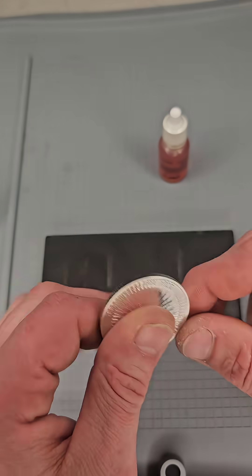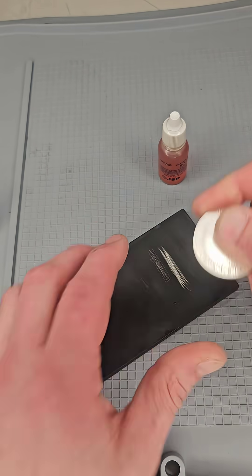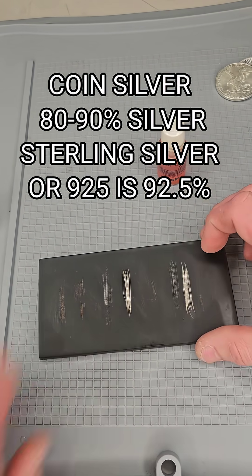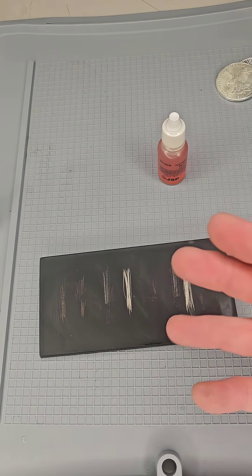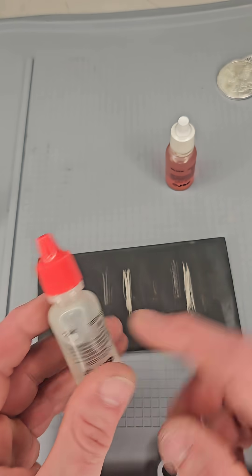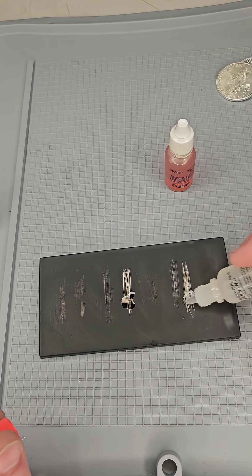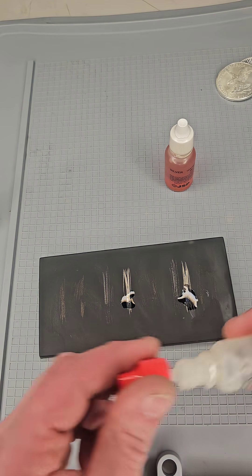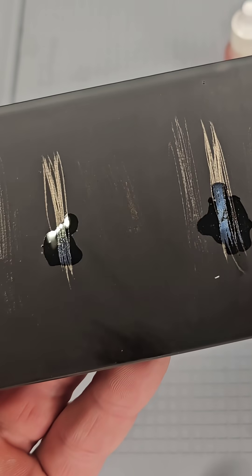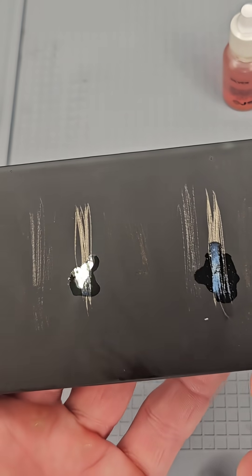I have two silver coins. This one is pure silver, 0.999. We're going to put the acid right there, nice and thick. Most coin silver is 80%. Now the trick here is the best way to test it is not with the silver tester — it's actually with the gold tester, 18 karat. What happens is it will turn blue. The higher concentration of silver will turn a brighter blue than the lower concentration. As you can see, brighter blue, not as bright — so you can kind of tell the purity of the silver.